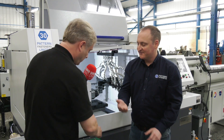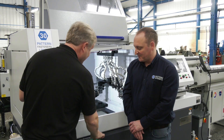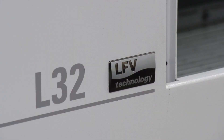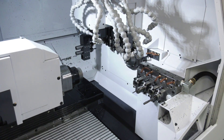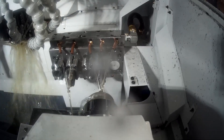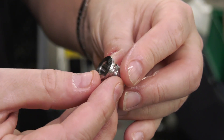We've mentioned the older Citizen machines and the newer L20 LFV bought last year, but this is your latest acquisition, the L32 - this is what they make on it. Why have you bought it? Well we felt we needed to expand our capacity on the larger sized parts, up to 32mm. The machine's more reliable than the older machinery, tends to run for longer, the LFV helps with that - you don't get the birds nesting and that type of thing - so it's given us strength in an area where we were a little bit weak in the past. Now this part here - that's not 32mm though?